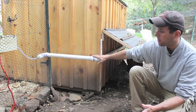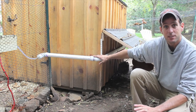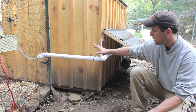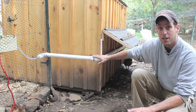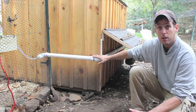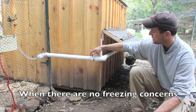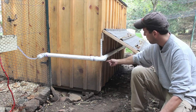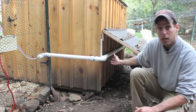With this system, I have two systems: one is the non-freezing system and the other is the winter ice condition system. This first system is connected to a garden hose 24 hours a day, seven days a week. You never have to worry about feeding them water or cleaning out the container. It pressurizes this PVC pipe to about one or two PSI and supplies these chicken nipples that the chickens can access at any time.